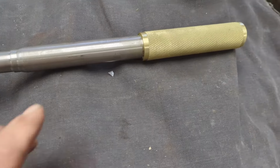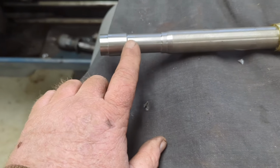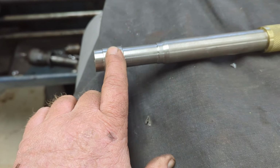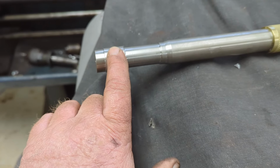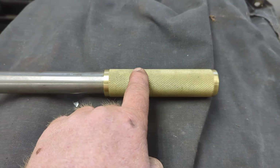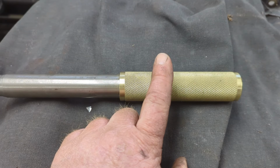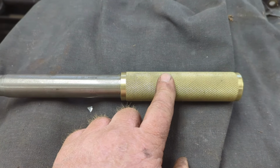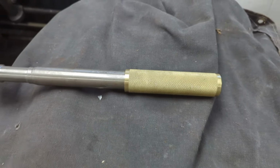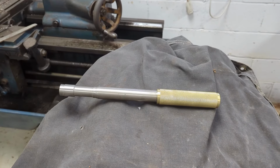There's the handle. I think it turned out pretty good. So the next step is we've got to cut some flats on here for where the casting's gonna go. And then I also wanna cut a flat on each side of the handle because I think I wanna stamp the owner's name and the channel name in it. So I think we're gonna do that next. We'll cut the flats. And then we'll be ready to cast the head, hopefully. So, getting close.